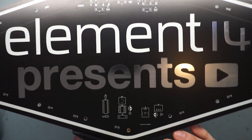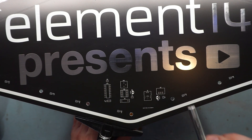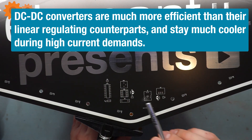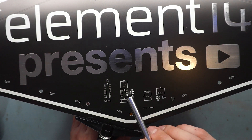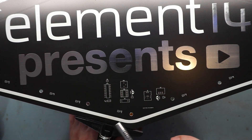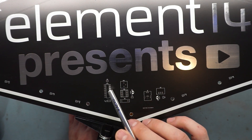The first step is that we're going to start installing some components one block at a time, the first of which will be the voltage regulator portion of the circuit. I've got a DC to DC converter here that goes from 12 volts to 5, and we'll make sure that that's actually occurring at the proper voltage. Once that's complete, we'll move on to the 555 timer, and we'll double check the waveform and make sure that the timing is good on that. I think I want to cycle all of these outside bulbs at like one second, maybe a little bit longer.